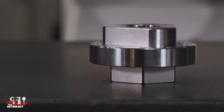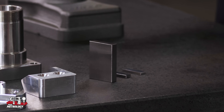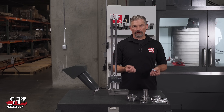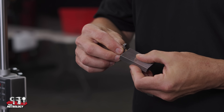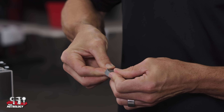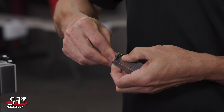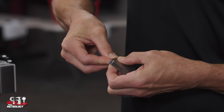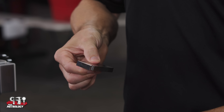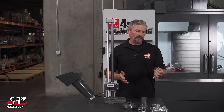The height tolerance for this surface is 2.270 plus or minus one thou. So I'll use three gauge blocks: 2 inch, 0.15 inch, and 0.12 inch. I like to ring them together — start with them 90 degrees rotated, press them together as you rotate until they're in line. You'll be able to feel the friction between the blocks increasing as you rotate them; that tells you they are mating correctly. When done the blocks will stick together. Ringing the blocks this way retains the full accuracy of the stack and makes it easier to handle.